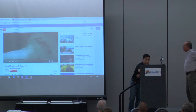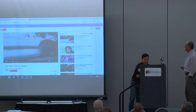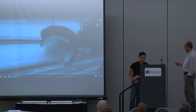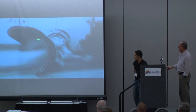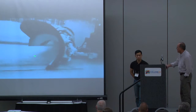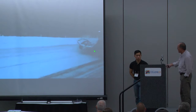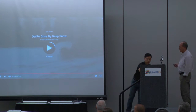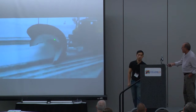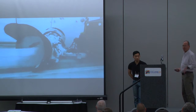The next video is a hybrid plow bit. You can see how efficient they are, but you can also see the snow starting to build up inside — we're not getting the scour effect. Instead of rolling up inside the moldboard, the snow is pushing forward and building up. Notice the length of the moldboard here — it's a full curl. The snow isn't scouring; it's pushing forward, and you get buildup. You'll see a big chunk of snow fall because you're not getting that scour that cleans the moldboard.